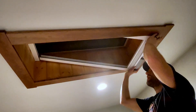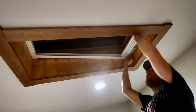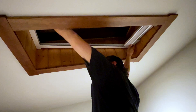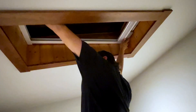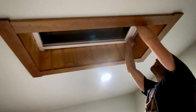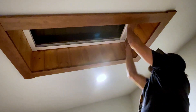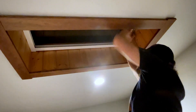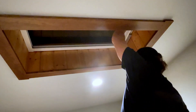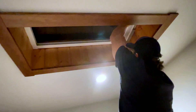I fit the ends in — this will fight me a little bit. I just need it to fit all the way within the Z-channel at the bottom, so you can kind of bend it open to get it down far enough. I get it all the way up into place, push it up against the edge so it matches up with the holes from before, and get the screws and screwdriver from my pocket to get those started.